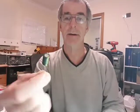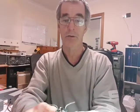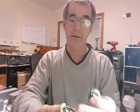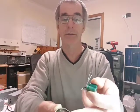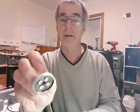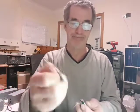They're very small, but they are 400 volts and 10 uF, rated 105 degrees. So I put 3 together, join the commons, and then I'm going to mount that on there. Unfortunately, this is aluminium rivets, and when I cut into it, it left little prongs sticking up, so I'm going to try and solder onto them hopefully. If not, I'm going to have to drill through the rivets and try and solder it on, but hopefully I'll get away with that, so we'll see how it goes.